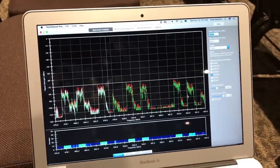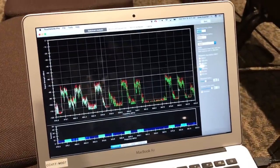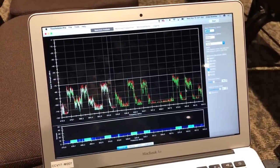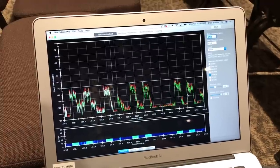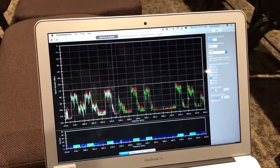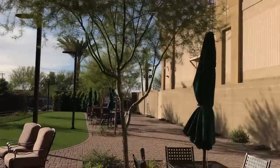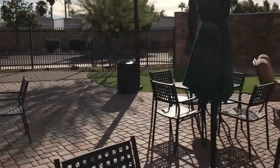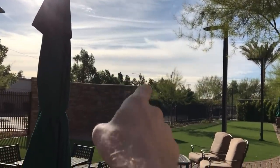Now I'm going to do the same thing but outside — take the RF Explorer outside to get a clean reading outside the building. Then we'll plug this into the intended distribution and get a reading of what the wireless receivers are receiving. Outside now, and we are facing towards the antenna transmitters for the TV stations, which are south of us.